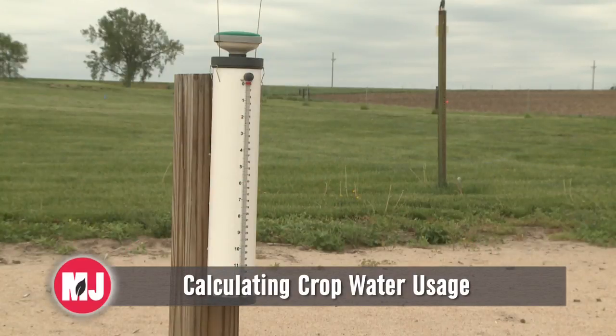The other option for producers is to use a data logger. That data logger is going to record the values for the watermark sensors every couple of hours, so producers don't have to go out in the field to check them, and they can also download that information at the end of the season. The next step for producers in the Nebraska Ag Water Management Network who have an ET gauge or atmometer — the ET gauge is a tool we use to give us a reading of crop water use throughout the season, so we can get a reference ET and then calculate our actual crop water use.